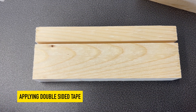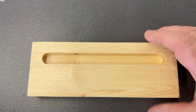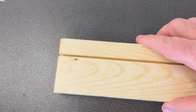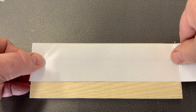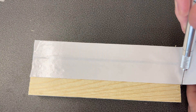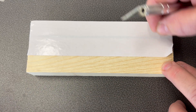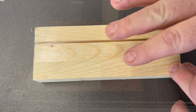Let's prepare the job. When preparing your model it's important to note which side to apply the double-sided tape. The pocket lives on the saw line underneath, so we need to place the double-sided tape across that surface. Place one full length strip, be very careful, cut your tape off and firmly apply it. Once applied, run underneath it with your hobby knife and peel it off — don't touch it once peeled because oil from your hand will cause it not to adhere to the bed.